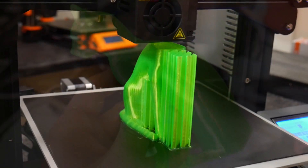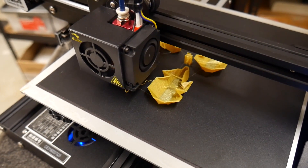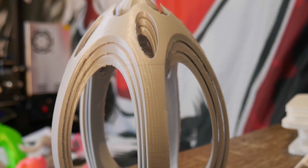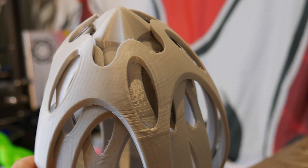I also did a PETG version in neon green and honestly I think I might prefer it over the PLA print — it's a little wispy and stringy but looks really nice, and I might start printing more in PETG in the future. For dimensional accuracy I printed a puzzle cube and although it's pretty tight it does work, with a 0.3mm clearance, so keep that in mind when printing parts that assemble together. Finally a stress test: the Easter egg torture test. Print quality is average with some ghosting and nasty retraction sites, but the parts do turn, which is difficult on an FDM printer. I had a settings mix-up with infill at the bottom — that's completely my bad — but the rest reflects the sort of print quality I'm getting off my Ender 3.